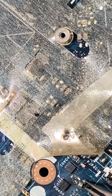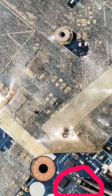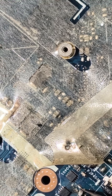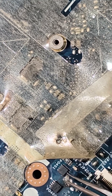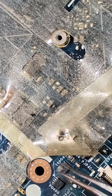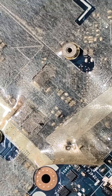This is a burn sign, and this is a capacitor. This capacitor is burnt, and that is one of the things that might be causing that short. So we have to remove this capacitor. We'll have to test it to know whether it's still shutting down or not.